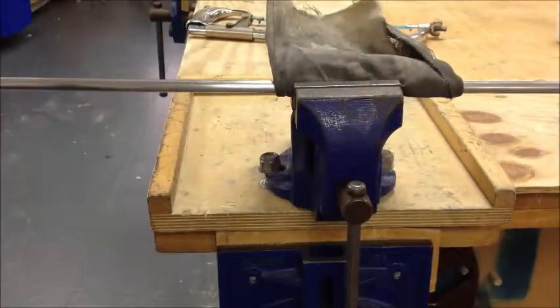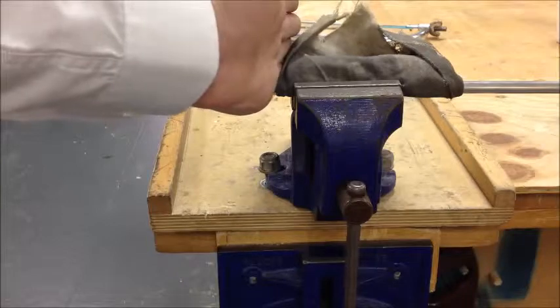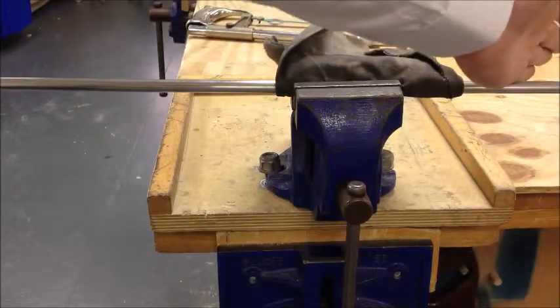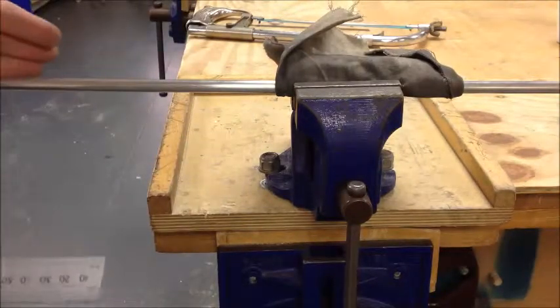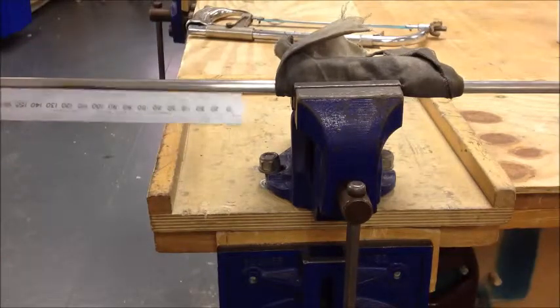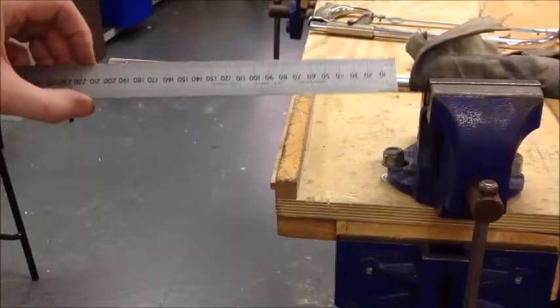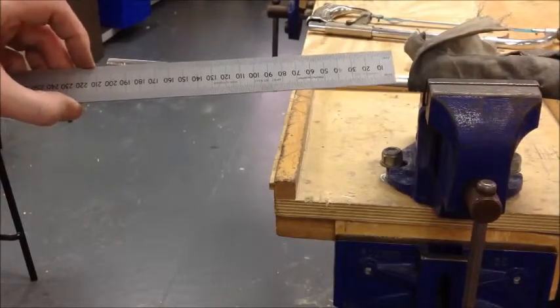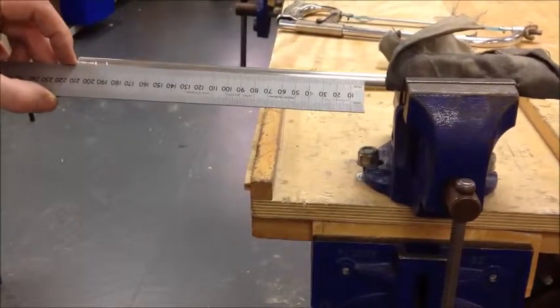The quantity of metal we need for each upright for the clock is 210mm. So we need to cut this piece to 210mm, and the remaining piece also needs to be 210mm. Using a steel rule, find out where 210mm from the end actually is. I'm holding the steel rule with 210 just at my fingertip — you can see my finger there, that's just at 210mm.